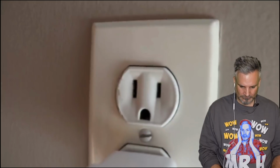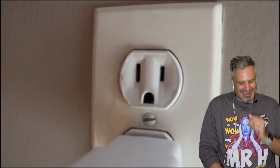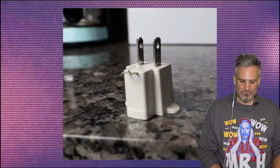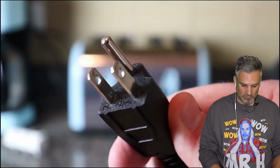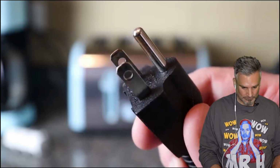Sure, Type B plugs, the ones whose sockets look like surprised ghosts, definitely do have 3 prongs. But Type A plugs, which are easily the more outgoing and competitive of the two, are bi-pronged. What's the difference, you ask? Well, Type B is a grounded plug and Type A is ungrounded. You see, this rounded third protrusion is known as a grounding prong that connects with the grounding wire.